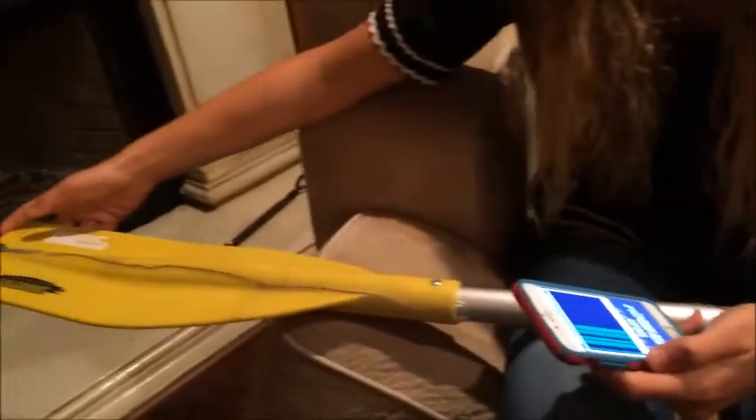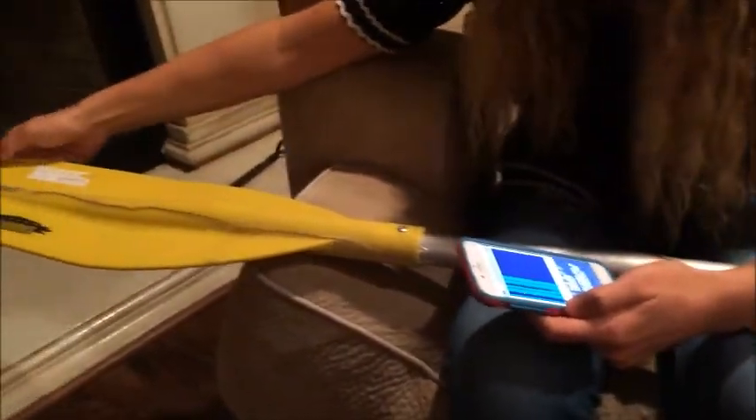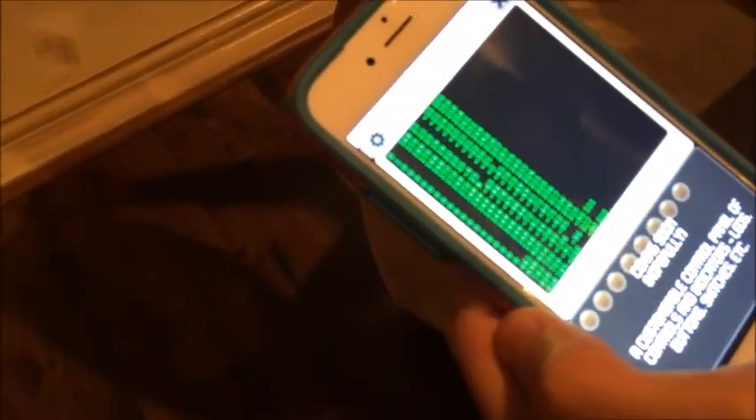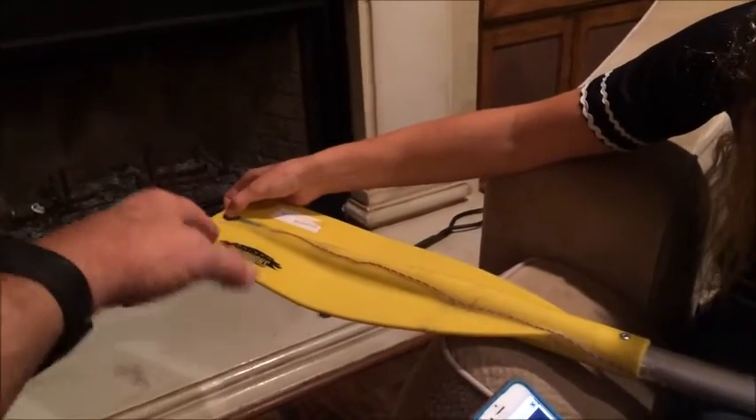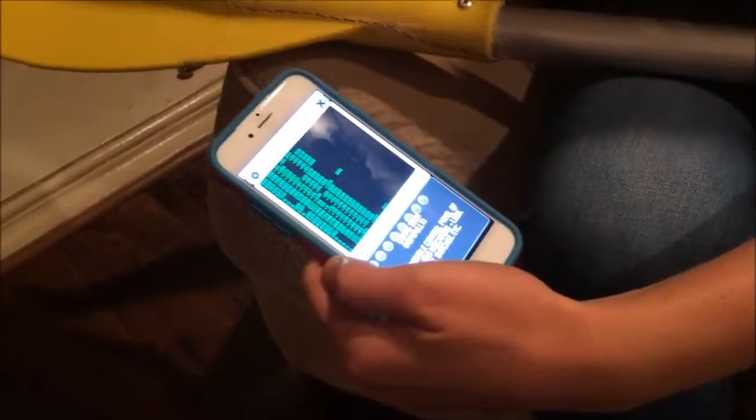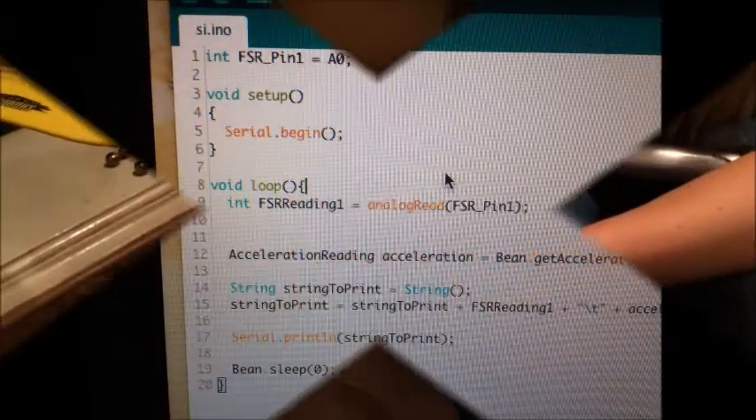The resolution is really terrific on this. When it's pressed down, it'll go anywhere from a zero condition — the maximum we can read is about 900 approximately. So we get a tremendous variation. This is going to be calibrated with some load on it, so we'll know the equivalent resistance change, or in this case the number representing so many pounds of force. Let's get an app built!